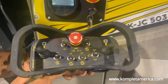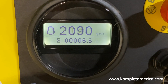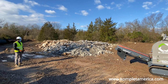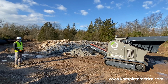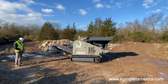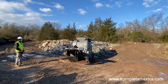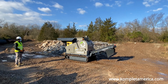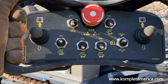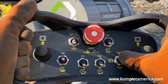Now that the remote controller is synced, move the accelerator lever to full throttle. The recommended speed for crushing is between 2000 and 2250 RPMs. Use the left and right joysticks on the remote controller to move the tracks, and if you need to turn 180 or 360 degrees, then make sure you are in turtle mode to easily turn the unit. When you have the machine in place on flat ground and are ready to start crushing, set your desired output size by pressing the jaw adjustment switch up or down to open or close the jaw inlet opening.